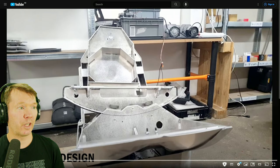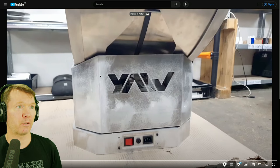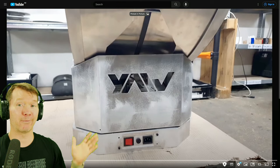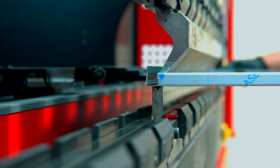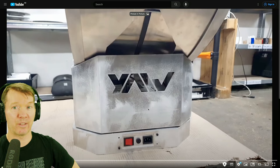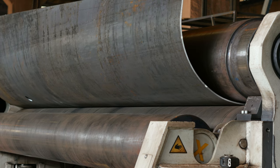The first very obvious change is to this angular design — it's somewhat reminiscent of a Cybertruck. This gives a lot of benefits: easier to manufacture, which means faster to manufacture, increased reliability and repeatability with these straight edge bends. There are well-established algorithms for how to do the bend, since you need to over-bend slightly and then the metal flexes back to the right angle. It's just bend, bend, bend and the piece is done. Whereas previously it was a really laborious method of rolling the metal to get a rounded edge, and very hard to do that with a high level of repeatability.